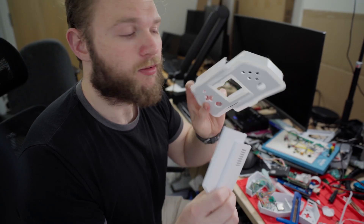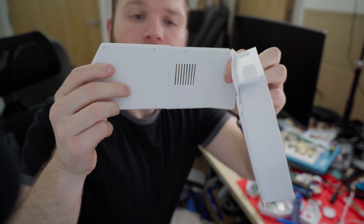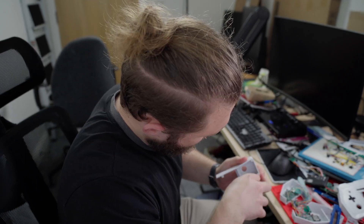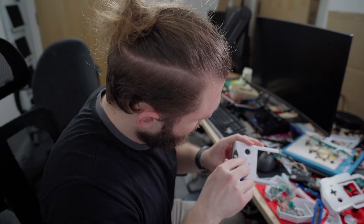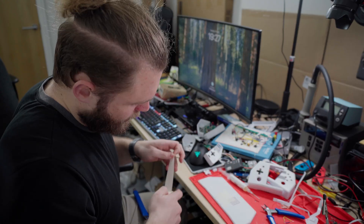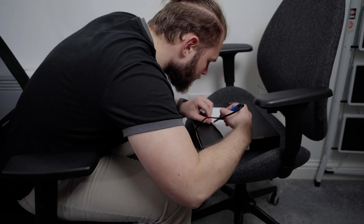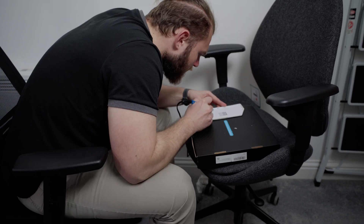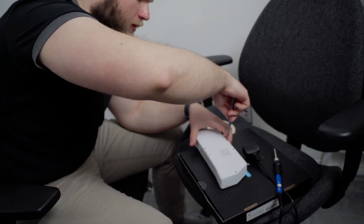An almost complete controller built from scratch — that's pretty good. I've got my shell printed, so now it's time to clean it up and do a little plastic weld, because there are two pieces and there should only be one. I started by cleaning the support material off the 3D prints, then taped the back cover pieces so I can fuse them together using a soldering iron — by far the best method for gluing PLA parts. Then I went to work on the back cover. After finishing it, I screwed in the front pieces so they'd be square when welding.